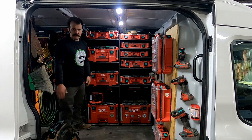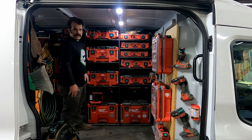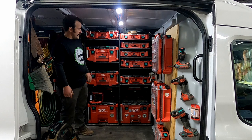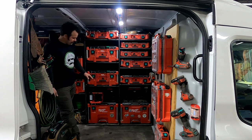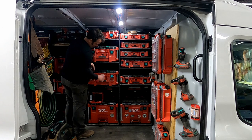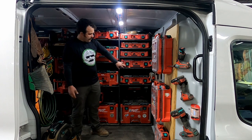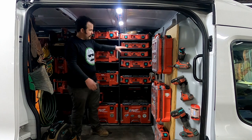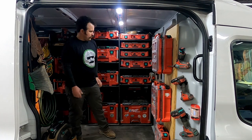This is my main pack-out setup — the first section of shelf I built when I built my van. I built it outside the van, assembled it, painted it, and then put it in place and attached it to the back wall. Like all the shelves in my van it's made with three-quarter-inch birch plywood for strength, everything pocket-hole screwed together with the Kreg jig. I spaced the shelves so that on some boxes I left extra space to reach in and grab something with the box still on the shelf. For the shallower boxes I had them on Kaizen brackets, but with a lot of weight the narrow boxes were hard to release, so I changed them to an angled shelf and now they slide out easily.